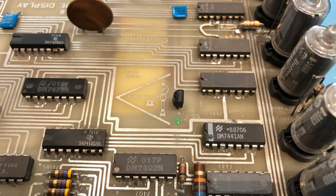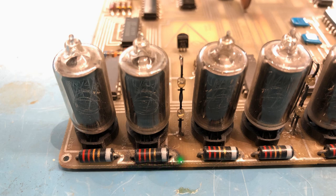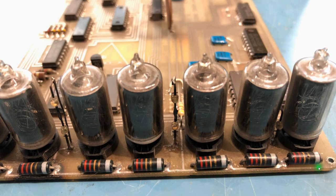There's an MPS-something transistor here — I assume it's a high-voltage switching transistor, potentially being used for the colons. The more I look at those colon indicators, the more I'm convinced they're LEDs, but we'll find out as we dive deeper. You can see here where the current-limiting resistor for this tube burned up and delaminated the fiberglass on the board; it's been replaced with what looks like an exact replacement. These are 22k resistors — pretty typical for current limiting when working around Nixie tubes. The high voltage comes in, gets distributed to each resistor, and then each resistor feeds each tube.